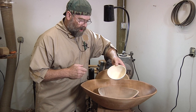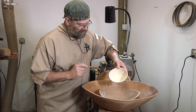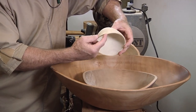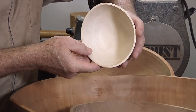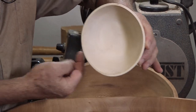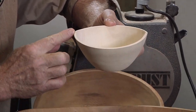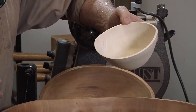I'm going to talk just a little bit about warping. It is not always predictable, though generally it's kind of predictable. If you look at this little piece of holly, this is the center of the tree. It orients on the tree this way for up and down, this being the outside. Generally there's very little shrinking up and down the tree but quite a bit around the girth of it. That's what gives it the oval shape — if you look at it sideways, high on the ends, scoops down and comes back up again. That is fairly normal for these.